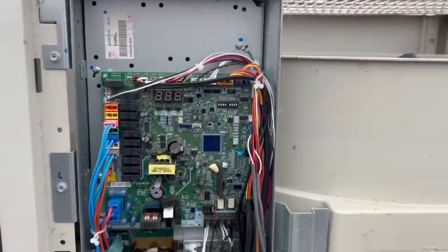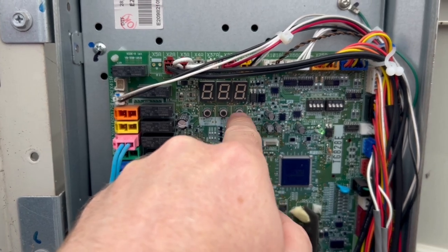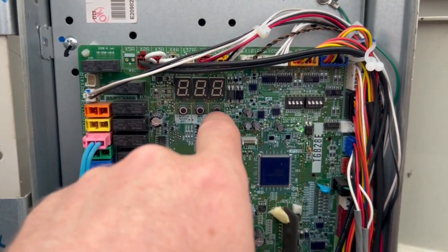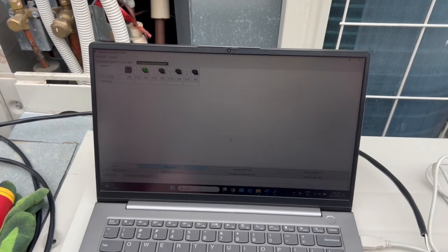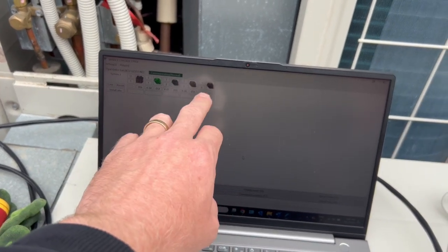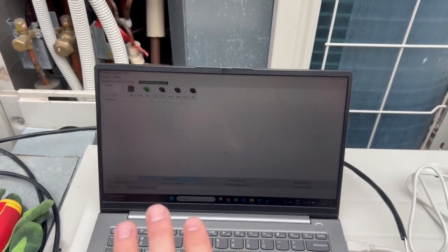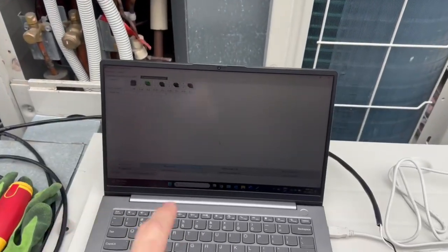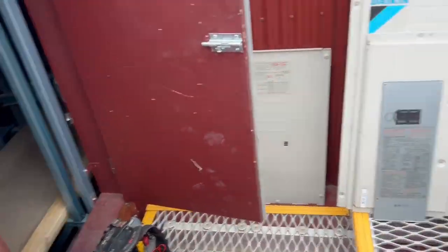I did check before - I think it was nine or ten indoors it should have. Ten indoors it should have off it. What I'm going to have to do is go downstairs and work out what area this actually does and see if I can locate the indoors. So we've got addresses 53, 54, 55, and 56. If I can find those air net addresses, I should be able to work out what else is going on - maybe there's just one without power or something like that. It does kind of seem that this board is actually okay, it might be an issue with somewhere downstairs.